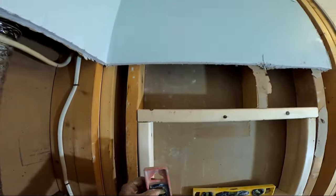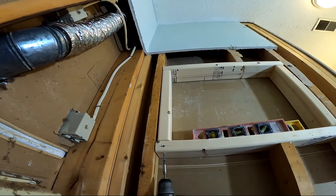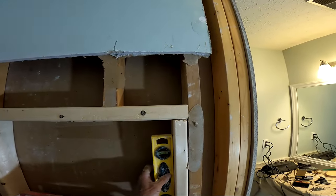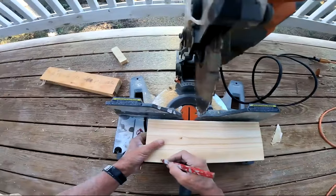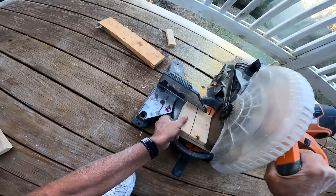I try to get the niche somewhat centered, and I think I accomplished that here. I'm cross-checking with one-foot levels since this space ended up shorter than my two-foot level. I'm using three-inch deck screws — in this case it's a condo so I didn't want to drag in the compressor. I'm constantly checking level and measuring top-to-bottom and left-to-right to within a sixteenth of an inch. There's some manipulation later with thin set and tile, but prep matters.